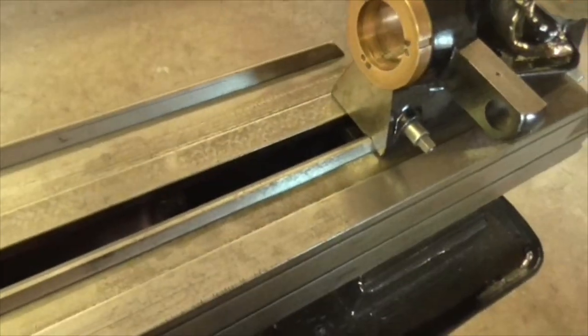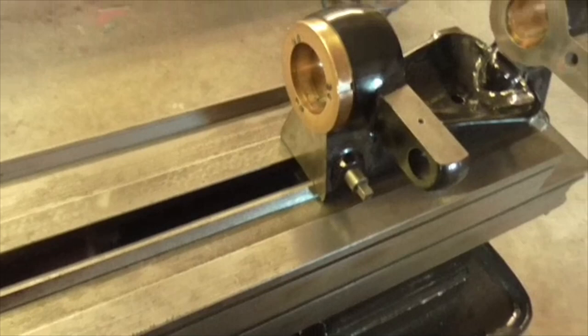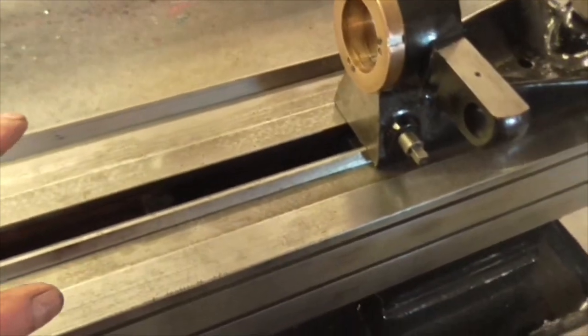I've also had a revelation with these. Now, these are over centre cams that lift these steel blocks underneath the bed and clamp the headstock to the bed. Now, I was being told that these were really difficult to set up and they were a bloody nuisance. And I agree, they are a nuisance, but I found a way of doing it that works on this machine.